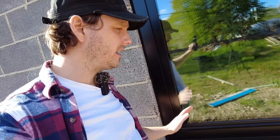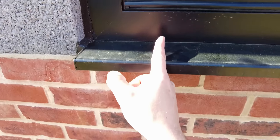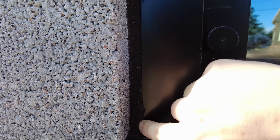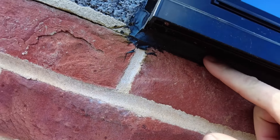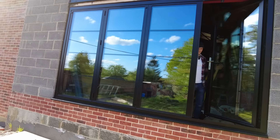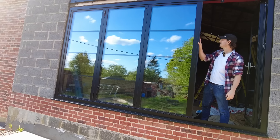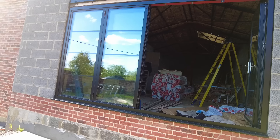I need to confirm exactly how this leak is occurring. This is the problem corner — the fixing is roughly about here. You can see I've used expanding foam tape around here, and then from there I've used backing rod and silicone. It's not coming from underneath — there's no gaps there. This end cap isn't quite on and there might be the tiniest bit of gap there, but the water just needs to go out the right way and not down through the fixing into the wall.